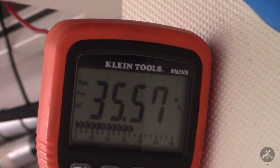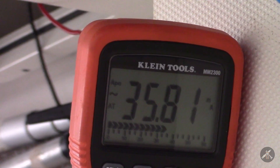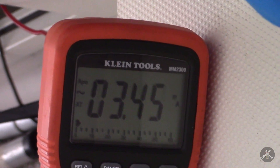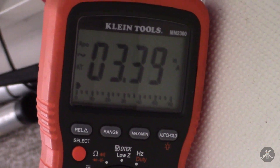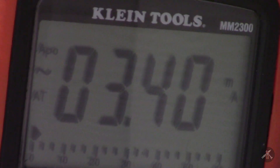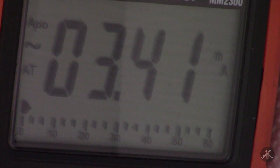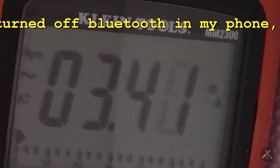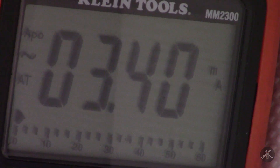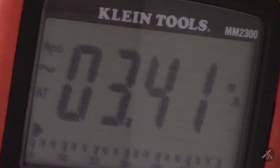Just as a double check — motor plugged in and Bluetooth transmitting reads 36 milliamps. Monitor alone is 3.4 milliamps. I turned off Bluetooth and shut down the app, and I'm still getting 3.4 milliamps of draw from the system somewhere. The motor is disconnected completely. The battery charger is hooked up but not active.